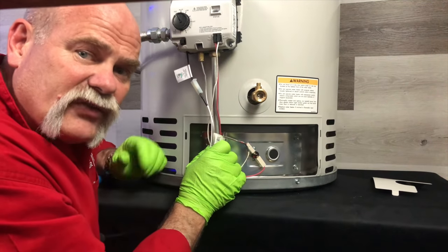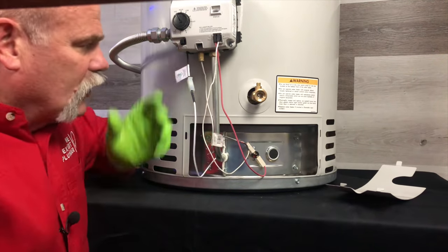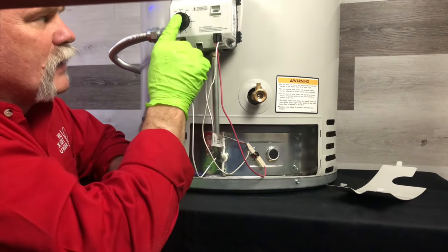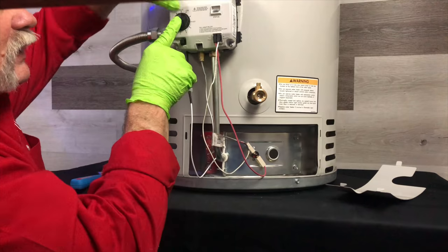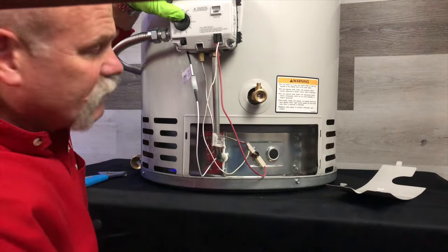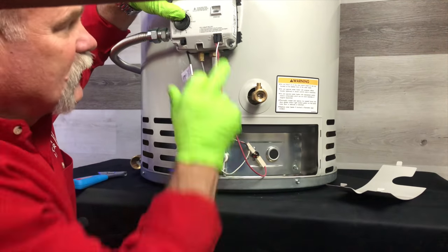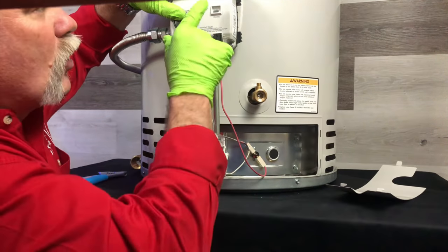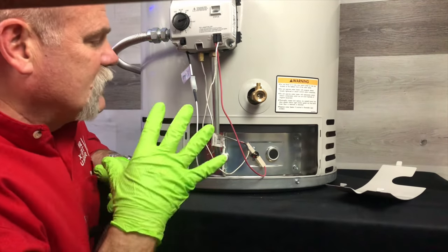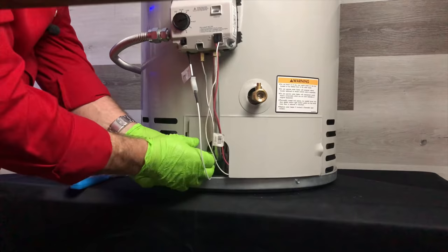There's really not a lot to it — this is something you can do at home to save money. Turn your gas valve 90 degrees to turn it on. Once it's on, you have gas back into your control valve. Take your control valve, turn it over to the pilot position, and press it in. Once it's pressed in, you can press your piezo switch — that's going to create the spark that you'll see through the sight glass. Once you get a flame, keep holding it in. Now we don't have gas turned on here so this isn't going to light, and my thermocouple is not going to heat up. But once it starts flashing, you can turn it up — I normally like to go just above medium. This is something you can do very easily, then put it all right back together.